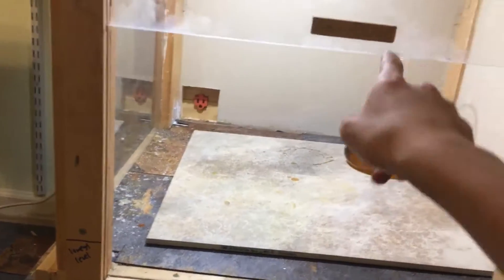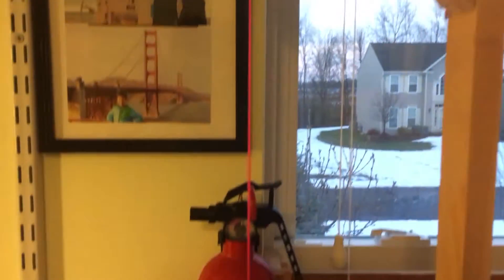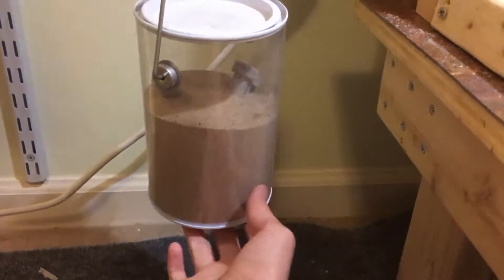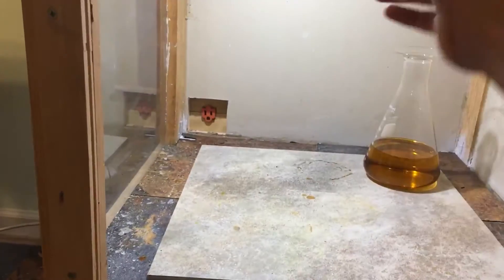In professional labs, you'd see a sash that goes up and down, counter-weighted in the back. I couldn't do that because I didn't have space back there, so I use a system of pulleys. You can trace this neon wire here, which leads down here — this is my counterweight. It weighs exactly as much as that pane of ballistic glass, which makes sliding the sash up and down possible so it stays in place. Without the counterweight, it would just slam down on my fingers, which is not preferable. With the counterweight and a little bit of friction, the sash slides up and down.